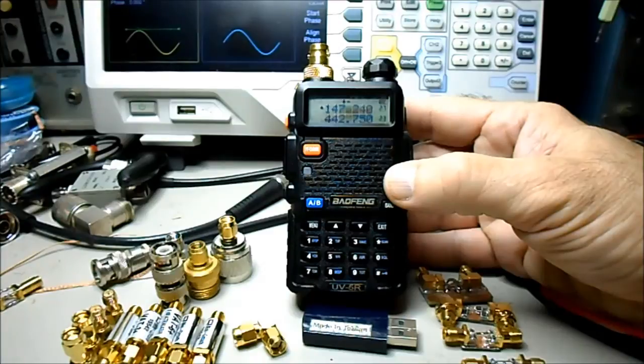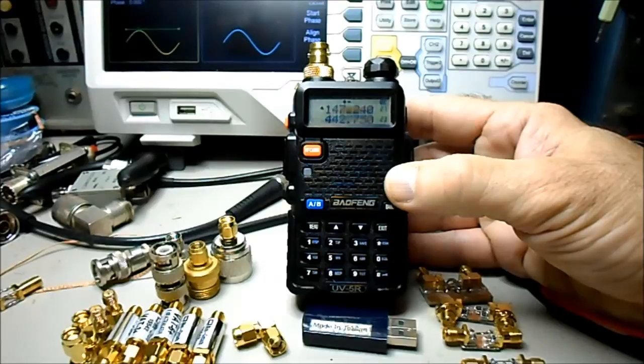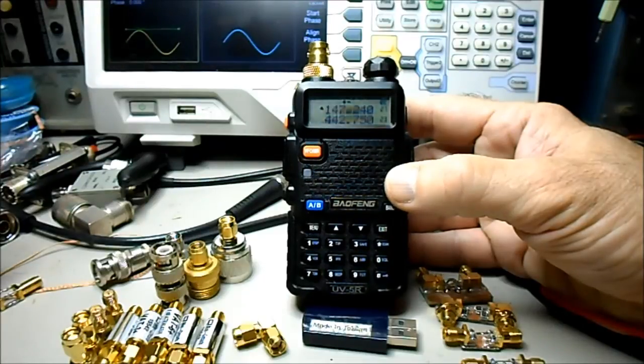If you're outside walking, it's just the duty cycle — and I'm inside, it's kind of stagnant, not moving around. A lot of these have a clip on the back that's metal, and when you tie it to the heat sink in the back with the screws and attach it, it tends to help act as a heat sink — but this one doesn't have that. So anyway, watch the duty cycle on transmit and receive; you don't want to mess up your display.